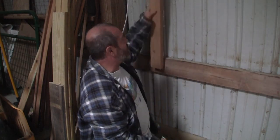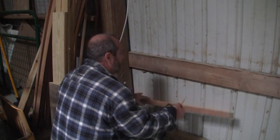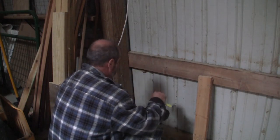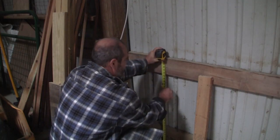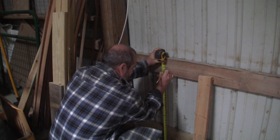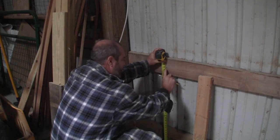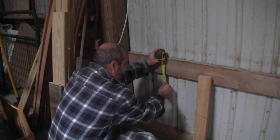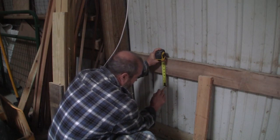So I don't really need any support here for this, but I'm going to put some sort of a ledge over top of this for the electric. Since we're at 30 inches, that's the top of the table. All right, so you're going to have probably a 3/4 inch piece of plywood on top of that, which brings you down to 29 1/4. And then I don't know how tall the actual, because I'm starting to think about a torsion box now, but if a torsion box is, say, maybe 5 inches or 6 inches thick, it's going to bring it down to about here.